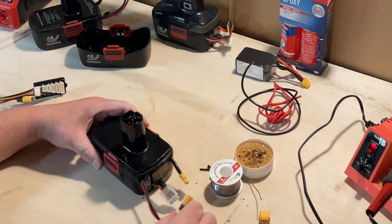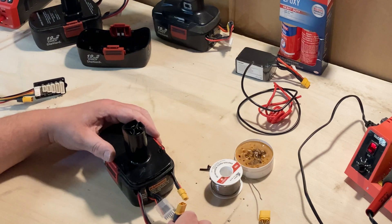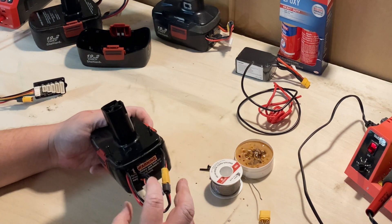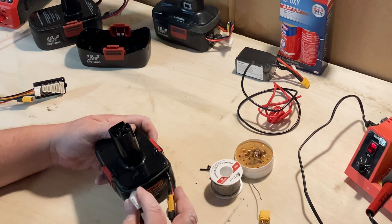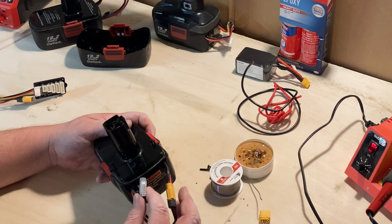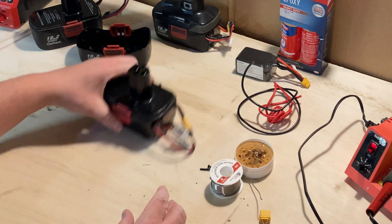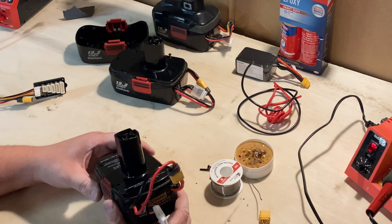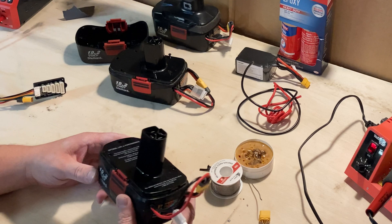The finishing touch is using your two cables to charge it up with your LiPo charger. Once done charging, disconnect the charger and reconnect the top of your battery pack to your battery. For the cell balancing cable, I just let it hang — I did buy some vinyl caps to protect them but it really isn't an issue. You can blow them off with canned air before charging. This is the final product all put together, and it works really well. The ampacity is every bit as good if not better than a comparable two amp hour Craftsman lithium battery.